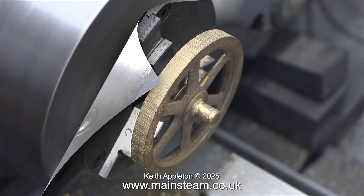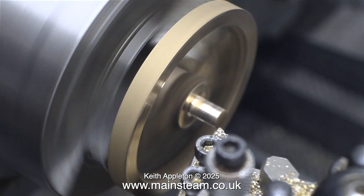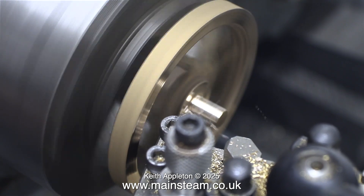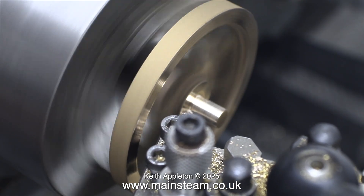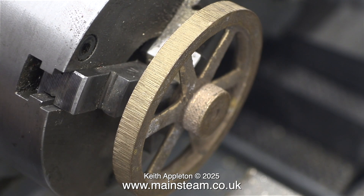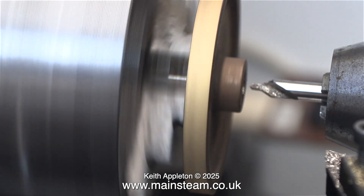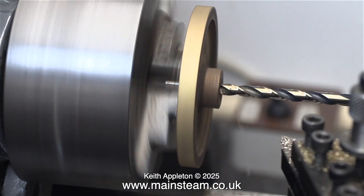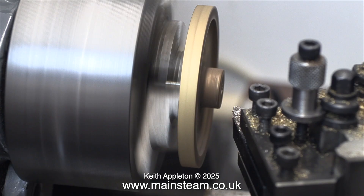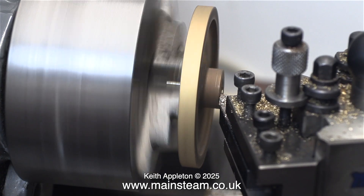Here's the operation — it's obvious what I'm doing. After machining an accurate register, I turned it around in the chuck to drill a centre hole and machine the other end. Then I drilled a hole one imperial size below 7/32 of an inch but I didn't drill it all the way through. I could have drilled this hole all the way through, which would have made the spigot release the flywheel onto the drill bit, but I didn't want to do that. You'll see what happens later on in the video.